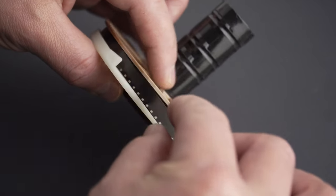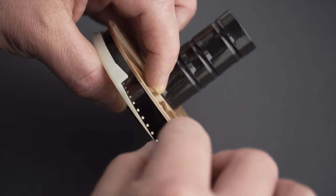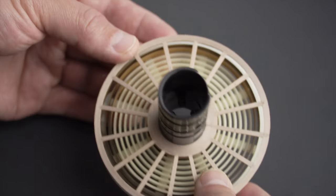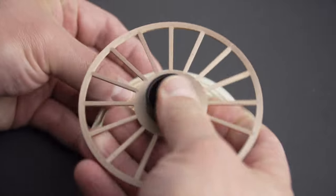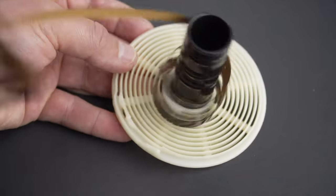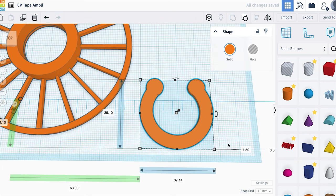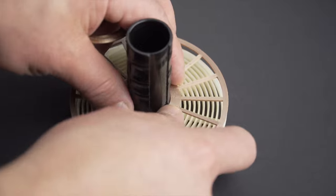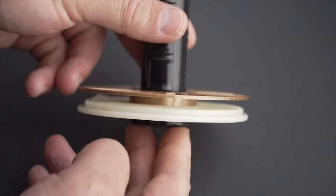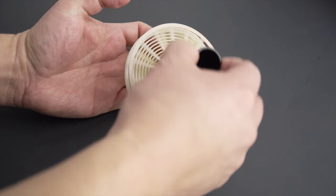I played with the reel and loaded the film several times, and I noticed a couple of things. One is I have to make a locking mechanism to keep the top part in place. The other one is I have to remove the steel ball that they use to advance the film. The steel ball is putting a lot of pressure on the film, and since Super 8 is so small, the ball may scratch the area where the image is. I tried several solutions and finally I was able to design a part that keeps the top part in place. It's not exactly strong, but it gets the job done.